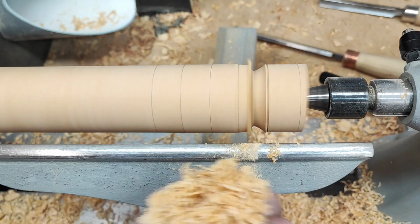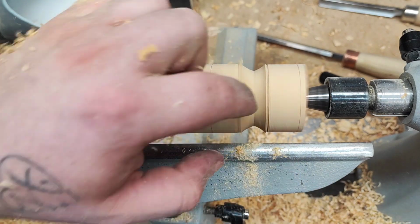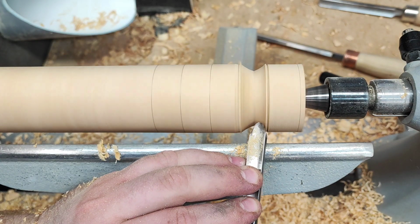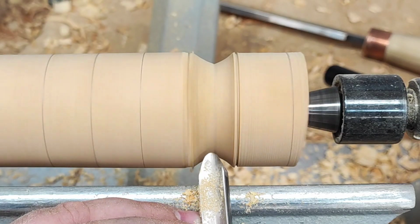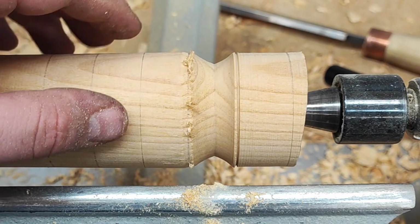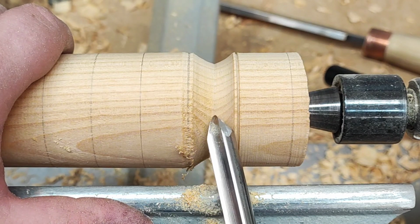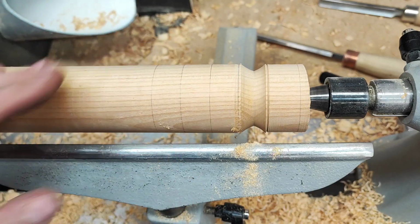to the halfway point. There's no point in going like so, because first of all this right side will be cut cleanly and this one wouldn't be cut, as you see, because you're going against the grain on this left part. And you'll see, if you can see, this part here is a little torn out, and this, the right part here, is nicely cut clean.